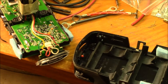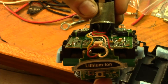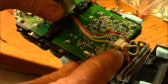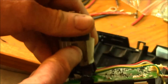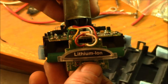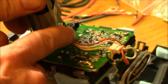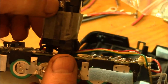That kind of backs up my suspicion that this fuel gauge was sort of added on. The first generation — I've got a battery pack older than this that has just the two wires and a push button, but no light up top. This seems to be the second generation fuel gauge. Then I've got a pack that has just the connector and this circuit board but none of these extra wires, so this is probably the second generation where they added the lights up top.